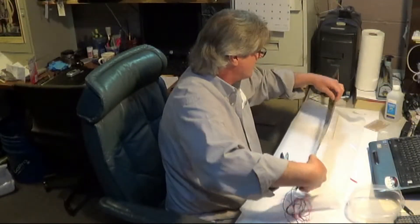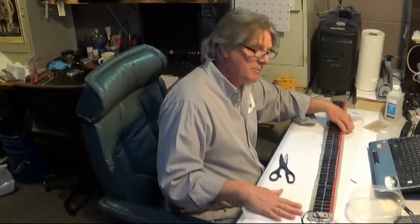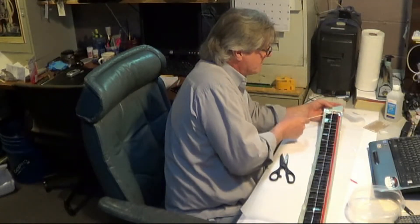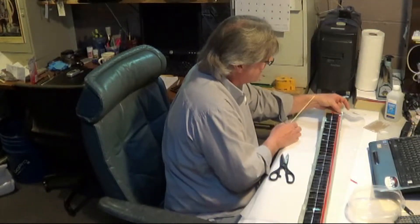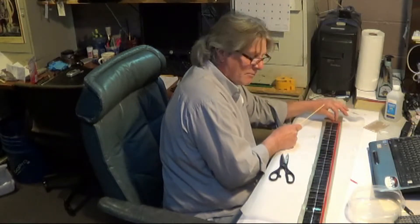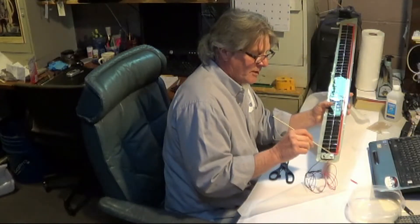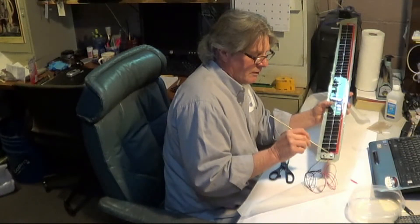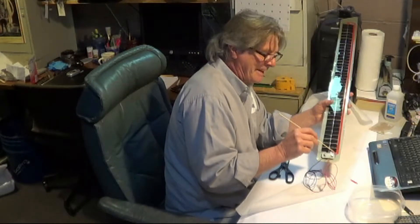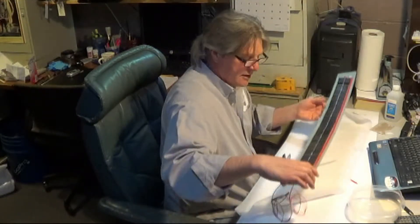I just can't wait to look at the other side — we're going to look at the other side just to see what it's looking like. I still have down my wax paper because I'm going to do a little bit more here with some epoxy. The red tape had come off while I was epoxying and I got a little bit of the epoxy onto the insulation bus wire area. So we're actually going to put a little bit of epoxy right here and a little bit down here by the squeeze connector where the bus wire is still exposed. It's nice and insulated going under here but right now it's just a little bit exposed — it's kind of just in the epoxy and I just want to make sure that's sealed real well. So we're going to put some epoxy in those two areas and this panel will be done.